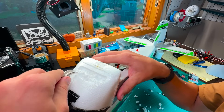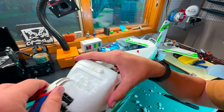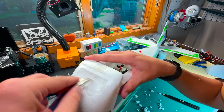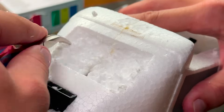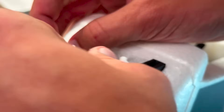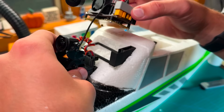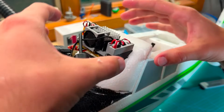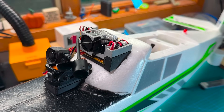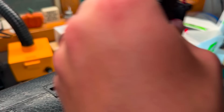Make sure you know what you're cutting into — if you're using a different plane with a smaller canopy, make sure you're not cutting into a strong structural part, an ESC, or something critical. It's just the process of picking out the foam, and you can go back and seal up the edges with hot glue or tape to keep everything nice and secure. After aligning the top two parts, everything is looking very nice — the camera gimbal slides in, the VTX just pops in, and we just now have to secure it in place. The first step is almost done.